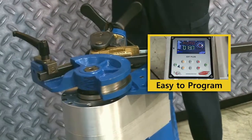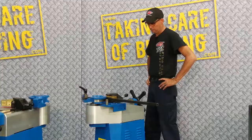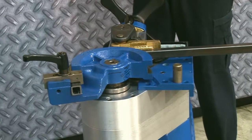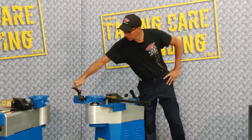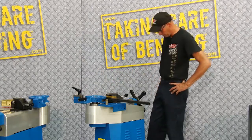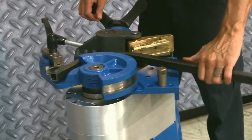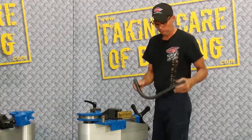Previously, I've set this machine to bend a 90 degree bend angle with 14 degree spring back. We've reached the end of the bend, so we have to release the gripping arm before we go into the return mode. This machine has an extraction plate on it, so when it returns, it'll extract the square material from the former — just like that. It's that easy.